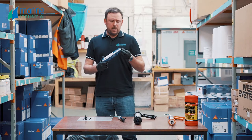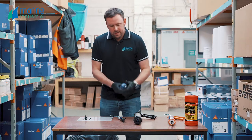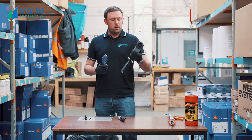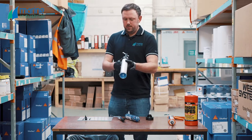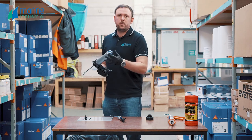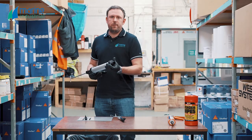The last of the packaging is the 400cc mini bulk. To use that, simply get a pair of side cutters and snip the end off — it will fit easily into a mini bulk dispensing gun, sold in either air format or manual. This is a manual one. Inside there's a plunger; pull back to open it up, pop your mini bulk sachet in there, screw on the nozzle, and you're ready to go.